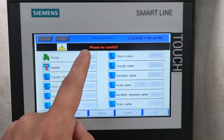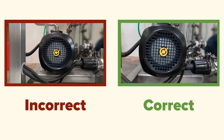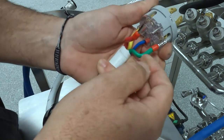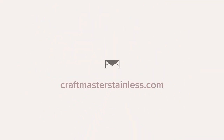Turn the pump on for a second and turn it off quickly. Check the spin of the blades on the pump and make sure they correspond with the direction depicted on the sticker. If the pump is not spinning the correct direction, you will have to modify the wiring sequence in the electrical plug. Please refer to the manual or our how-to video.